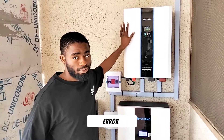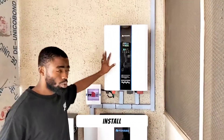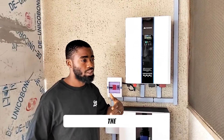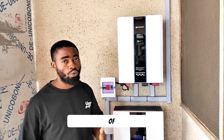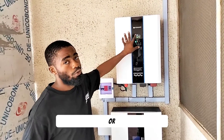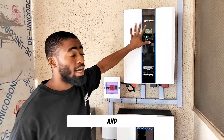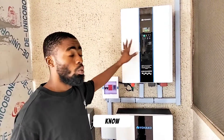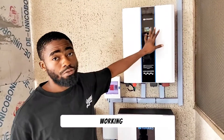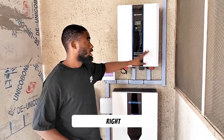The issue we encountered with this inverter was a factory error — not from us. Our installation is neatly done; we installed the battery, got the right measurements, and installed the inverter. But after everything, the inverter would run for a while and then trip off. We went up and down troubleshooting, checking the house wiring, until we noticed the temperature. Whenever the inverter was about to go off, the temperature would be around 49 or 50 degrees Celsius — too high. The inverter was shutting itself down because the fans were not working, and that was a factory error. I had to uncover the inverter and fix the fan. Initially it would work for 10 or 15 minutes, trip off, then come back on. Right now we have solved that problem.